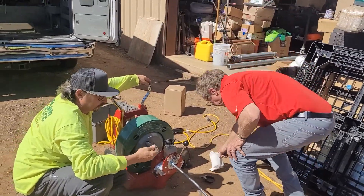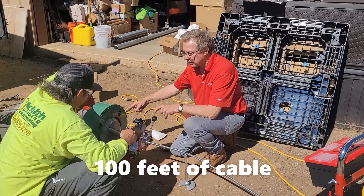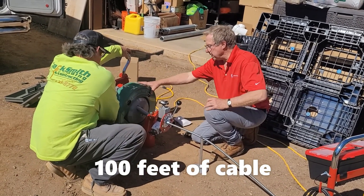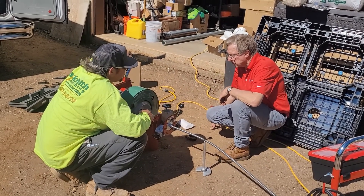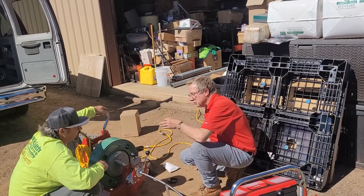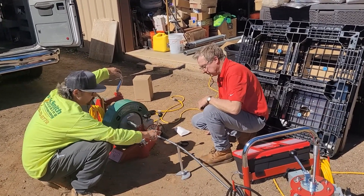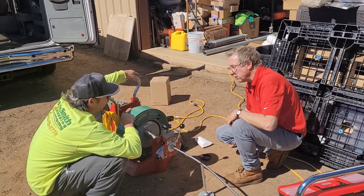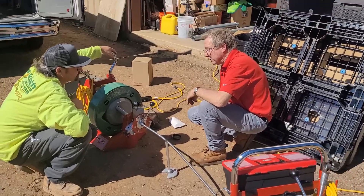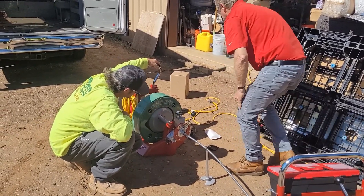Each length of cable in here right now is a 50-foot section, connected with a male-to-female coupling and a pin. Then there's another 50-foot section, connected to a 5-foot anchor cable in the back. So you've got 5-foot, 50-and-50. The idea of the anchor cable is if you've ever had to add cable to the drain — you go out your 100 feet, disconnect it, leave your 5-foot in there, grab another cable, hook onto that 5-foot, and it's a lot more traditional. Better to have too much than not enough — if you need something 56 feet away and you've only got 55 feet, that's the problem.